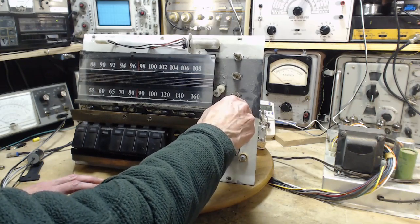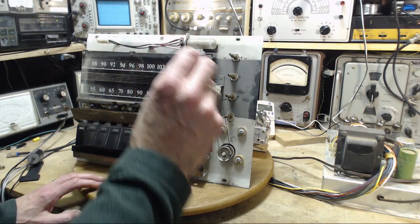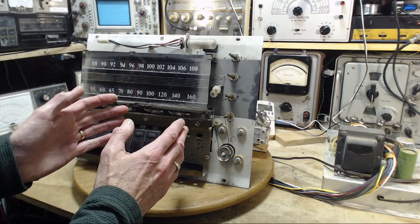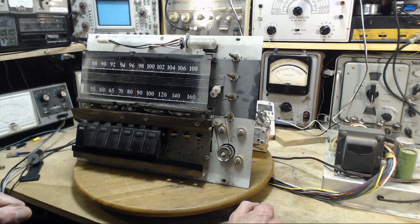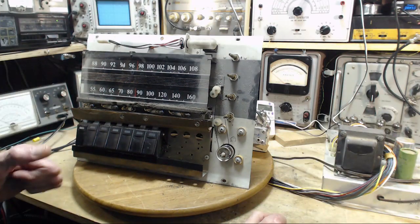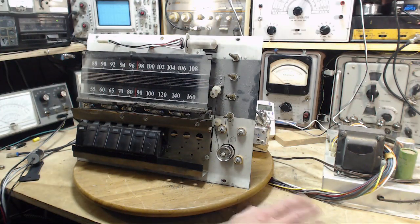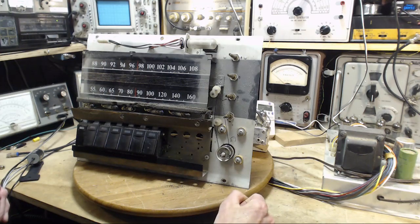Ooh, anybody hear that? Let's stop this for a second. Okay, so am I hearing things? I could be. What I thought I heard there in the middle of those pops was a different pop and then a deeper hum. It sounded like an overload hum. It sounded like something shorted for a brief moment. Heavy current through the transformer. That's what it sounded like. Could be something going wrong in the output tubes easily, threatening the output transformers. Risky business. Pops were pretty thumpy.